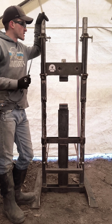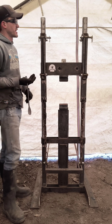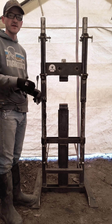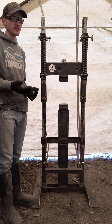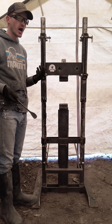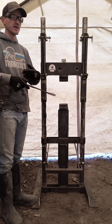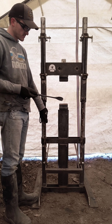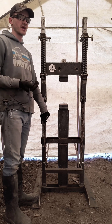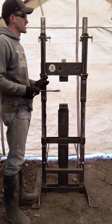So the main thing I wanted to accomplish with this treadle hammer was adjustability — that's the main idea behind this. Being a toolmaker, I don't have time to make tiny adjustments that barely make it possible to do what I'm trying to do. I don't have time to be compromising everything — compromising my tools, compromising the setup. This treadle hammer makes it so I don't have to do that. I can use all kinds of different tools not specifically made for a treadle hammer: hot cuts, punches, drifts, and all kinds of things, because it's adjustable.